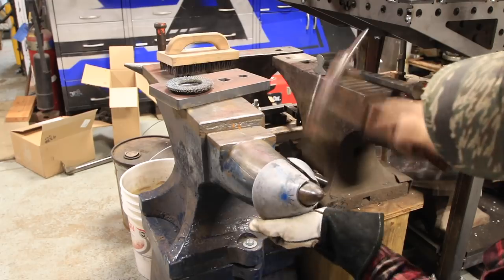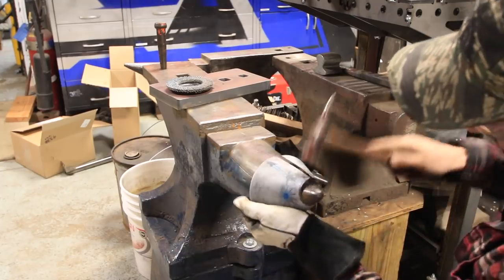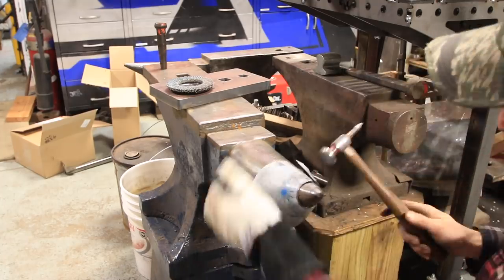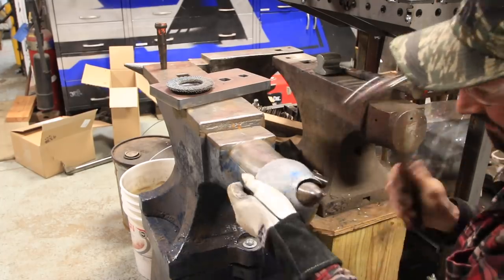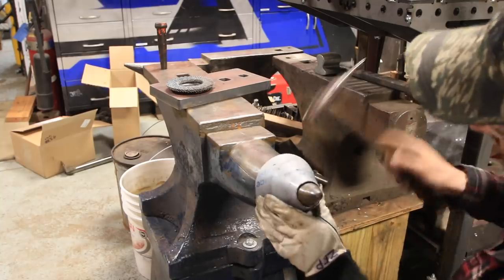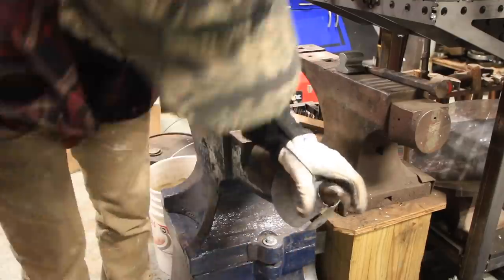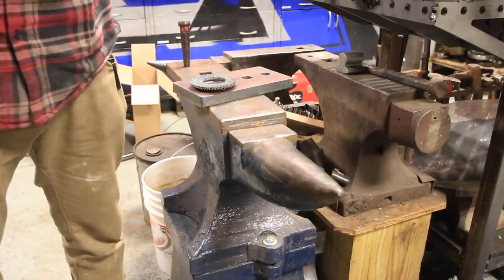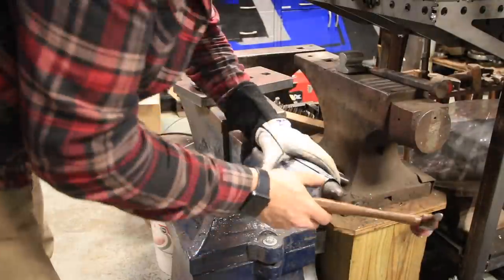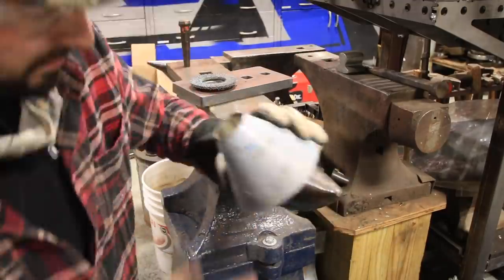Since I'm going to be brazing these two ends together, I want to make sure I'm able to close up the end of the cone. To do that I go over to the anvil and just start hammering in on the shape, which helps me close up those ends using this little body chasing hammer. I'm just watching those two ends, trying to get them closer and closer. By sort of hammering and shrinking the metal around that horn, I was able to help close things up enough that once I go to braze them there'll be a nice lap joint there.